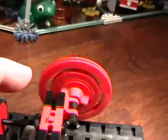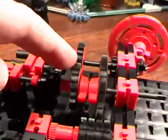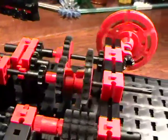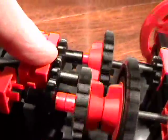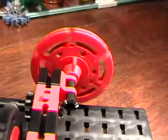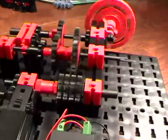Why is that? Well, here we have a big gear driving a small gear, which gives us faster RPMs. Over here, we're driving it with basically the same diameter of wheel, so it's slower. Moving the lever all the way to the left engages a reversing gear — that middle gear — changing direction. So we have fast, medium, and reverse.